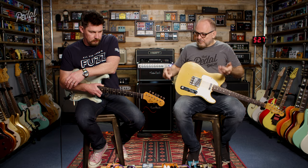And then a light bulb went on because I hadn't had this problem before. Yeah, this is really interesting. Been using the Secret Machine on my slightly bigger board without this problem. And then it dawned on me. So this is the pedal I'd been using for the early slapback echo. And what do we know about the Belle Epoque Deluxe in its standard mode? It's buffered. It's not true bypass. Because it has that 22-volt preamp in there.